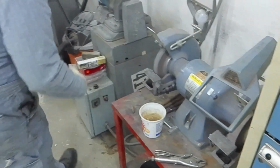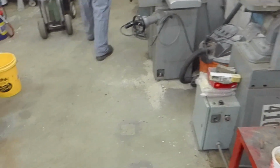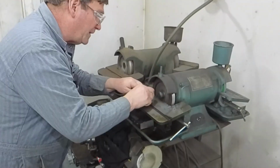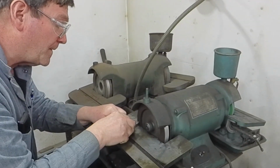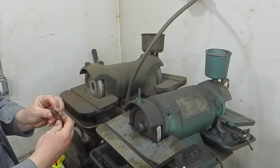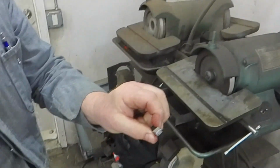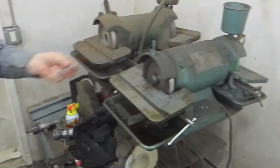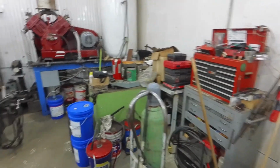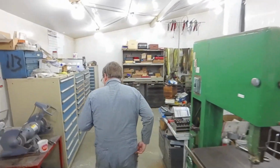And then we're going to come over here because we want a really nice finish on this, even though these are not normally what you use for grinding high-speed steel. These are normally for carbide. But it puts a really nice finish on the end. And if your boss doesn't catch you, you can see how much better the finish is on that part that's ground with the diamond. If your boss doesn't catch you, you can sharpen your pocket knives on those really good too. But if you do too much steel without using an abrasive cleaning stick on it, the steel will clog up in between the diamonds and they won't work well. That's why a lot of steel grinding on them is not that great.